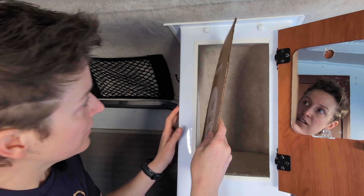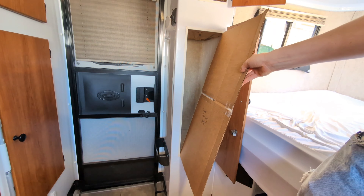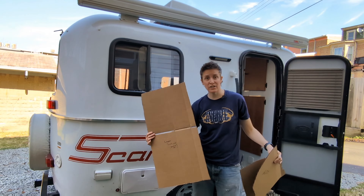I'm hoping that the wood will do the same. This is the upper south side. That one fits in well and it fits around the bolts. Lower north side. This right here is exactly why I wanted to put my templates onto something rigid — this door opening, even at an angle, isn't big enough for this template to fit through without bending in the middle. So I definitely need to shrink this a little bit when I transfer it to the wood. I'm going to cut just a little extra off the top so it will still stand up against the wall on its own power, but small enough to fit through without bending in the middle because my wood's not going to bend. I've got my templates and a good idea how they're going to fit and make it through the doorway.